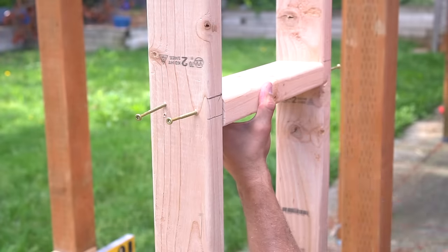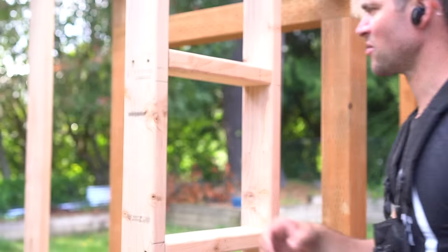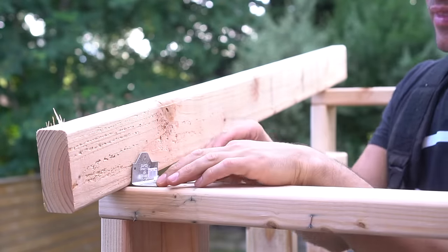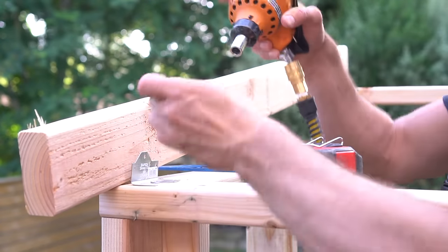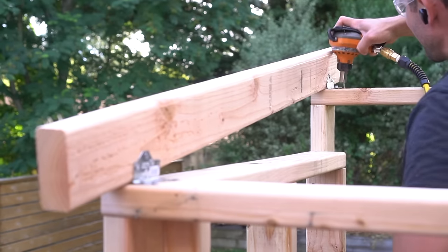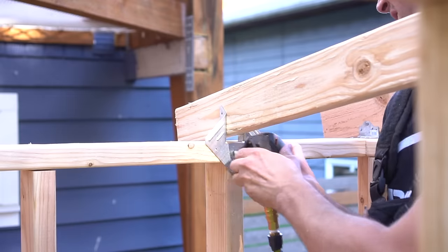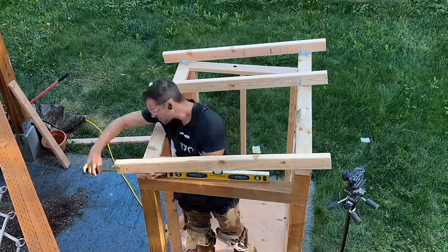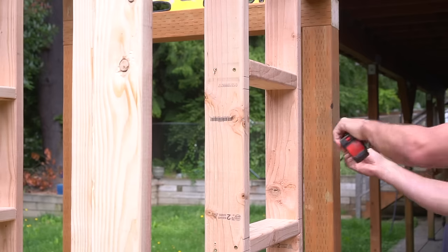You do want to have some type of daylight in this space, which is why I'm also framing out a window on two sides of our chicken coop. I cut up a few more 2x4s at 45 inches — I cut them at 45 inches because I'm going to be applying a second 2x4 on both sides, and since each 2x4 is one and a half inches thick, we have a perfect 48-inch long span. In order to properly secure all of our roof rafters onto our walls, I'm using hurricane ties and galvanized nails with a palm nailer. With roof rafters, you can space them out at larger distances like 24 inches, but because this is such a nice little chicken coop, we spaced them out at 16 inches on center.